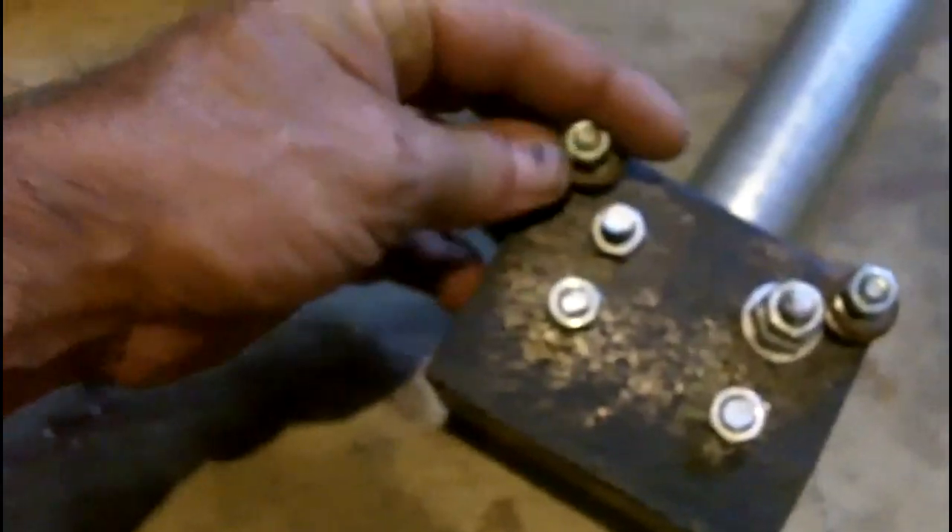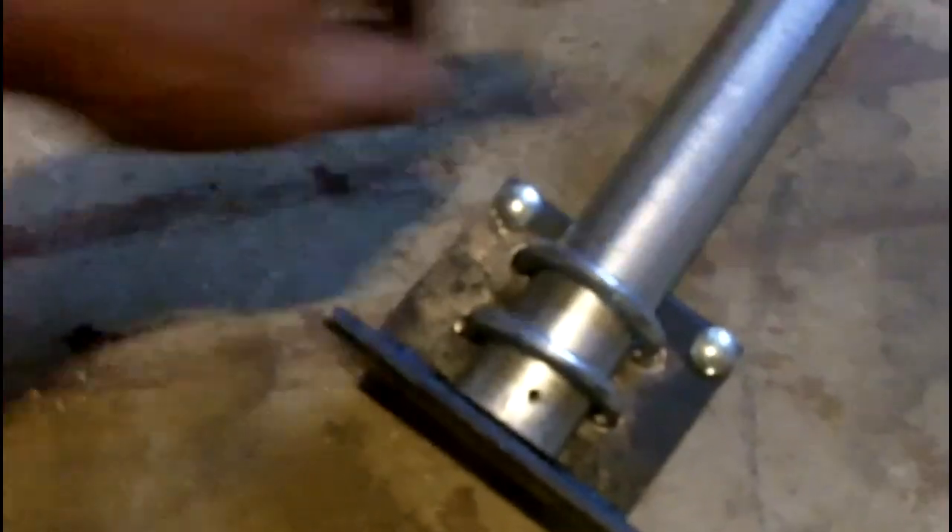On the top of it, I put a piece of angle iron and drilled holes in it. I went overkill — it's what I had around. It's a really hefty piece of steel, but I drilled it, put the U-bolts, and gave some points for mounting my ground plane wires. The ground wire that I put on that base is going to slip through that hole in this angle iron and attach to the pole, so the base of the antenna will be grounded to the pole.